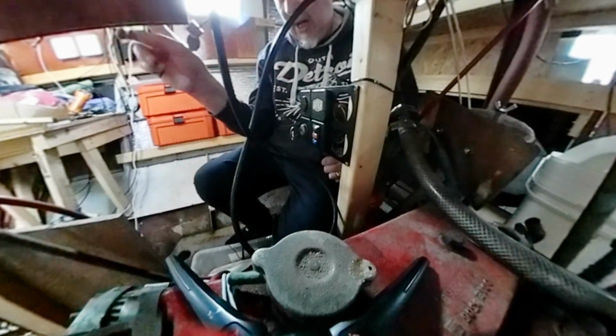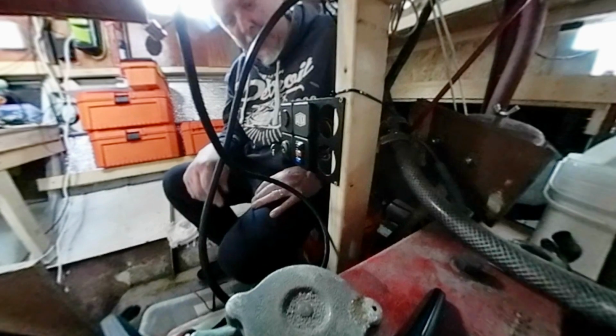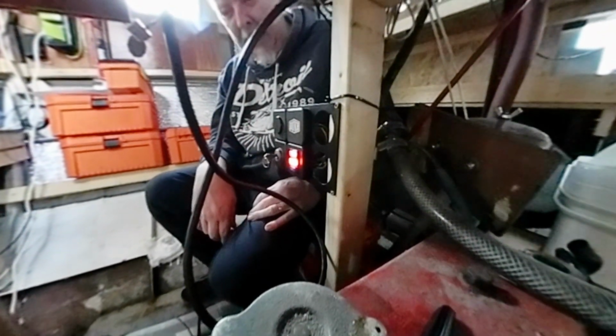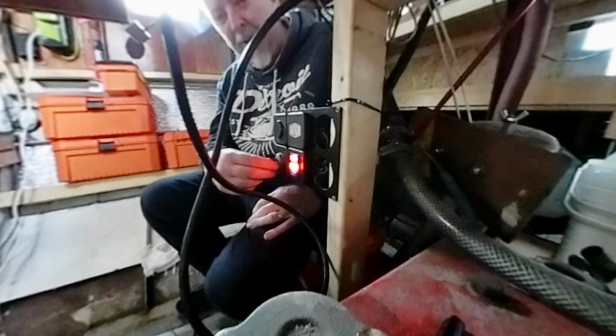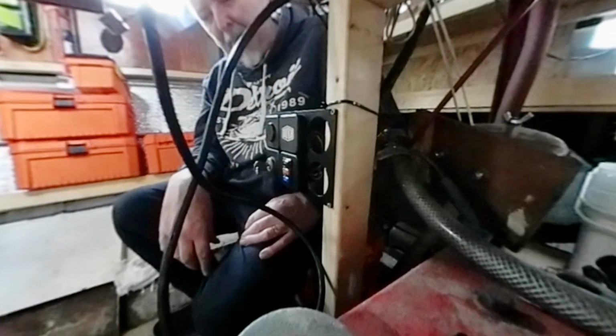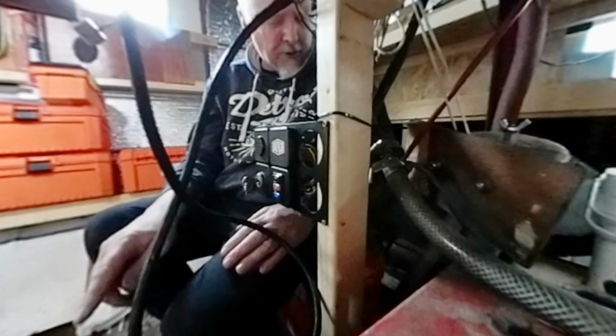I have connected the alternator and connected the battery. I've got an isolating switch. If I turn the switch on, no big bangs or anything like that, and lights come on here, but nothing. There's no sound or anything like that. So I don't know whether it's the starter motor that's goosed.